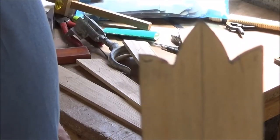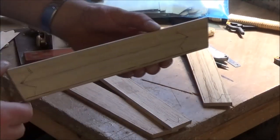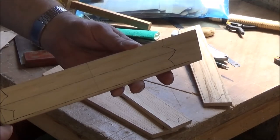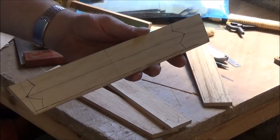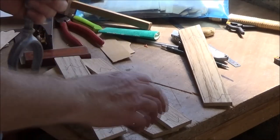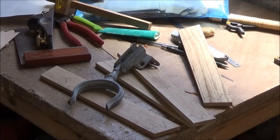Rather than just screwing into the wood, I'll bolt through to give a nice firm anchor. I thought I might as well make them a little bit fancy. I've come up with a trefoil shape, made the template up, drawn it out onto the wood once I split and planed it. I'll cut it out and nail it to the rails with copper nails and possibly glue it as well. It's going to have two bolts going through it from the rowlock bracket, going right the way through everything.